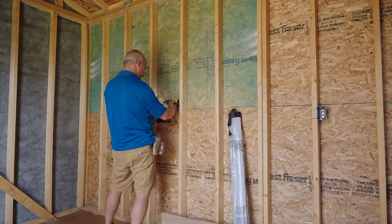This is a functionality contest, okay? Now, later on, when you've got it all sorted out and you know exactly what you're gonna do for a long-term solution here for your power, you can get a siding tool, release one of the joints, cut out a bigger piece, and put in a siding block. It actually has a face and a back, and you can nail it in and make everything look as pretty as you want. But for now, we're protected against moisture, we're protected against bugs, we've got the available power.